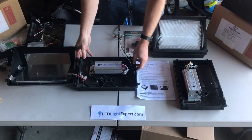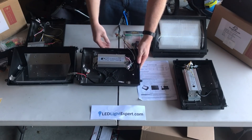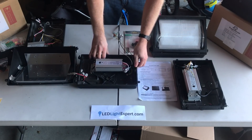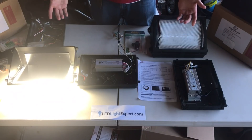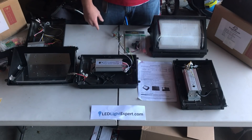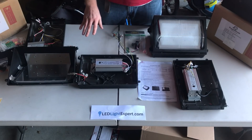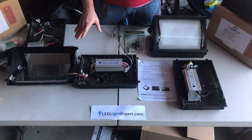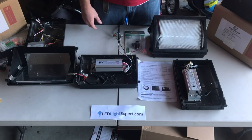For the photocells themselves, it's pretty simple. When there's light, the light's not going to come on. When it's dark, the lights are going to come on. It does take a few seconds — I'm covering up the photocell and the light comes on. It can take five to ten seconds once the photocell is uncovered for the light to turn off, so there is a little bit of delay one way or the other. Sometimes people have issues where they're getting some reflection from another light hitting the photocell even in the dark, so make sure you don't have any ambient light that is actually setting off the photocell and turning your light off when it's dark out. You might need to play with what's around the light to make sure the photocell is working properly.